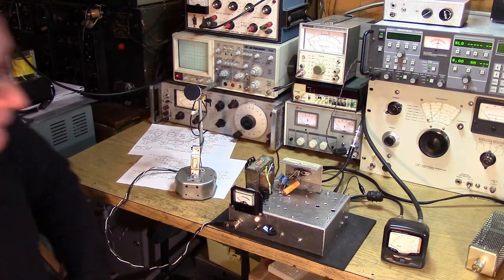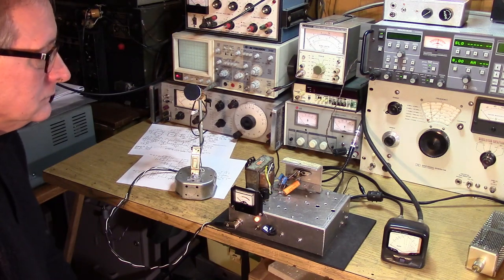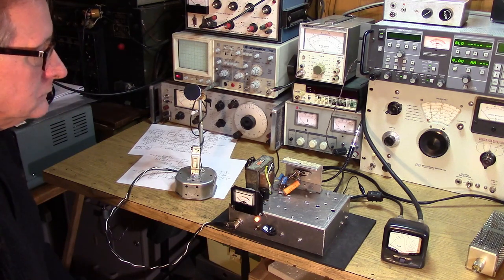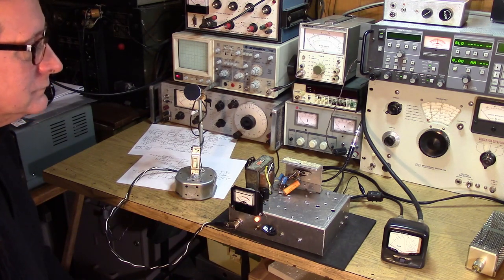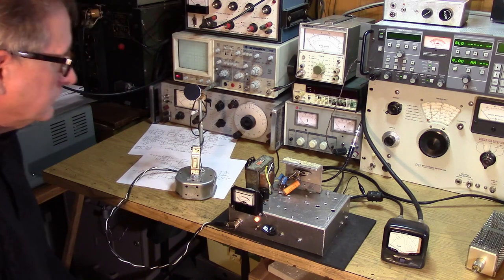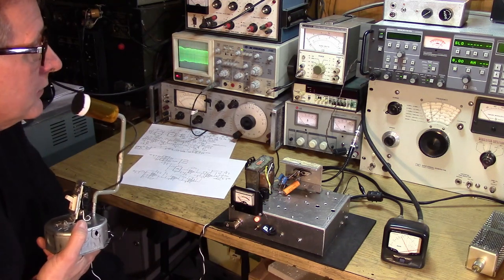Wow. Yeah, I was going to say, depending on the device, what if you raised your B+, say you used a little 48-volt switching power supply, and put, say, 30-some-odd volts across the modulator and the rest of it across the PA, so that would give you plenty of modulation headroom. Oh, yeah, that's possible. Absolutely. It's absolutely possible to do that.